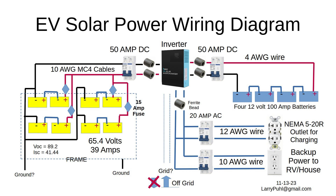This wiring diagram shows how the solar panels are wired in parallel and in series. Fuses are added in case one of the solar panels shorts. A DC circuit breaker allows the solar panels to be turned off if needed. Ferrite is used to reduce radio interference.